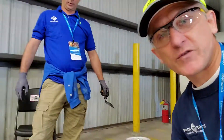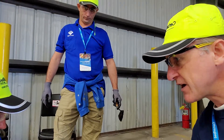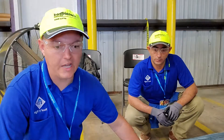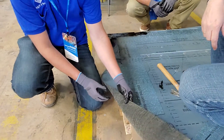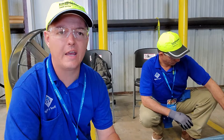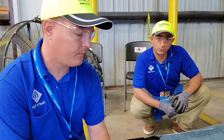How about that base? We learned that on decks like wood, OSB, or plywood, it's important to use nail-down base instead of self-adhering base. If the wood decking expands and contracts under thermal expansion or contraction differently than our modified layer, and it's self-adhered and fully adhered to the wood decking, that's going to cause failure of your underlayment. If you use a nail-down or mechanical fastener, it's going to allow that expansion and contraction of the plywood decking underneath.